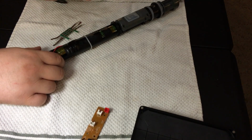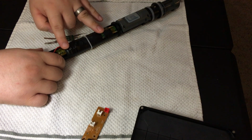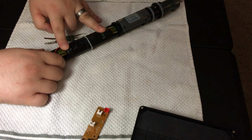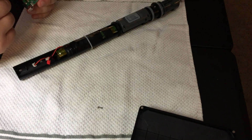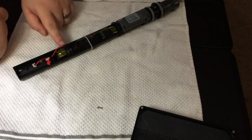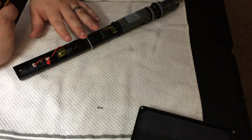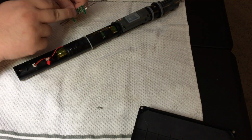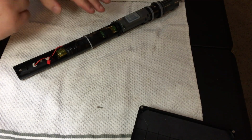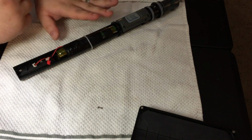The second thing is I wanted my wife to be able to have longer running, and that's the most important thing, is that having these in parallel instead of series allows me to run twice the output watt hours and keep the same voltage, which makes it really, really simple. So because I modified it, my wife is able to get many more cleanings out of this. She can go probably months without having to charge this guy now. And that's the other nice thing about these little management systems, is that they do a good job at keeping any kind of leakage current from happening on these cells, which is really, really nice.